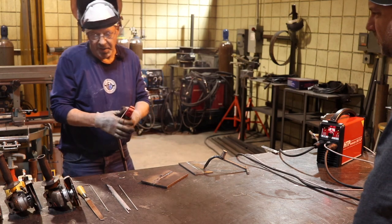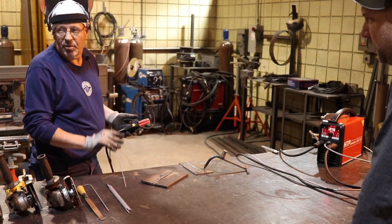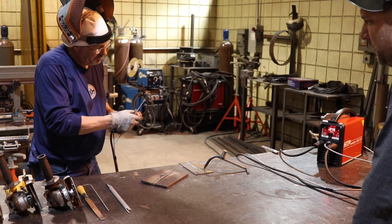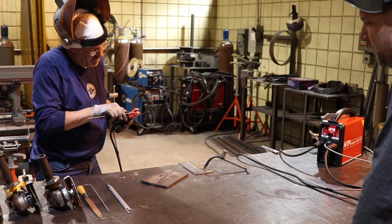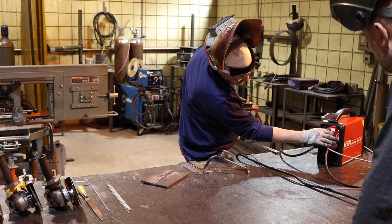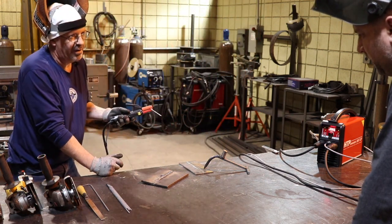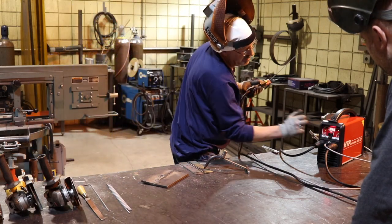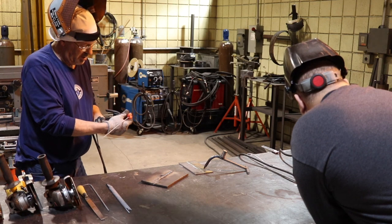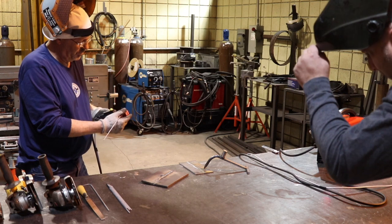It's not exactly what I thought it was going to do. That's why I wanted it up at 75 — the background is going to affect things and I'm having a hard time operating this because I don't do it regularly. So right now I want to go up to about 80 amps, so it's 80-40. I want to drop this down to 2.5 hertz. I was thinking 2 or 2.5. I'll do 2.5 first, but I'm probably thinking you want to be around 2.0.